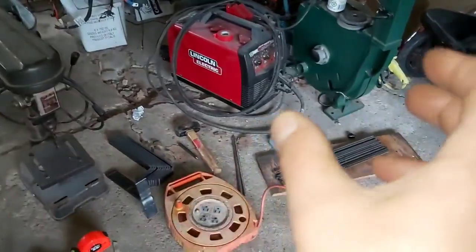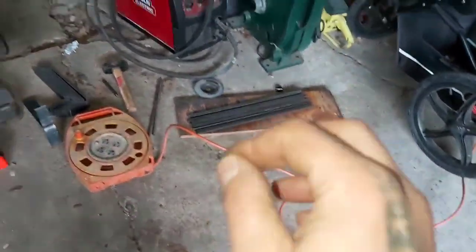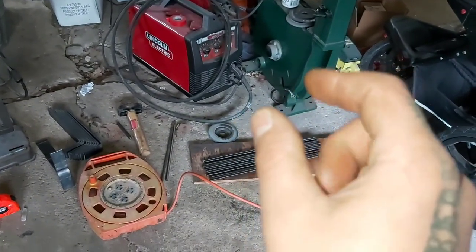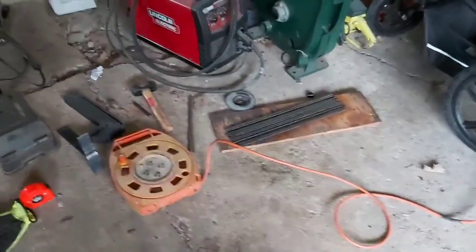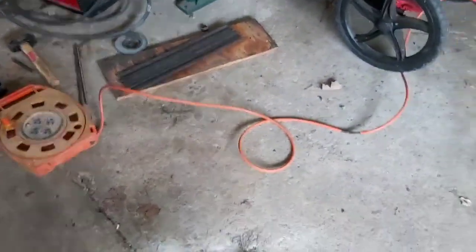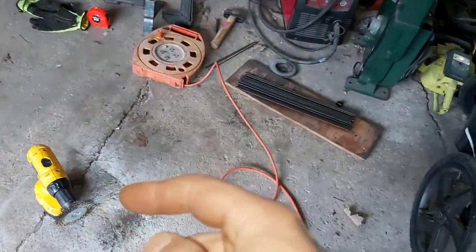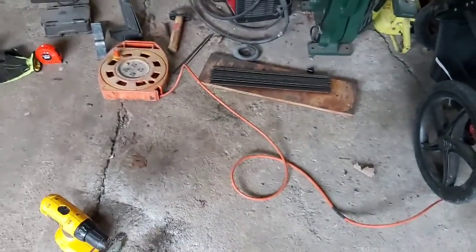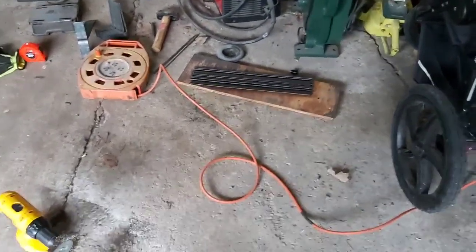Each 3.6 will have its own 4-gauge wires for paralleling and for the mains tied into the main negative terminal. And then we'll go BMS from terminal to the big wire out. And I'll do the same for the negative side. I'll put a 250 amp fuse on it as well, and then to the big wire. So it'll be three 4-gauge wires to one negative post, and then a fuse, and then 2-aught cable coming off that.